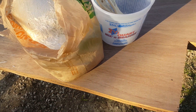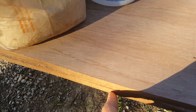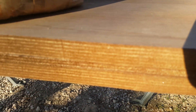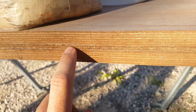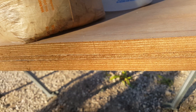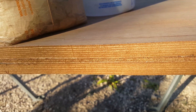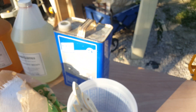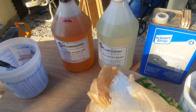Without further ado, I'm going to take two of these pieces of the transom off, dress up the bottom side first, and apply the quarter-inch sheet first. We'll dress this one up with the epoxy, then sit this one on it, then cover it with epoxy and sit the three-quarter on top. One thing to keep in mind is how much time we have — you want to consult the manufacturer on pot life.